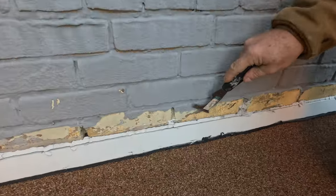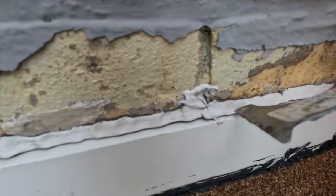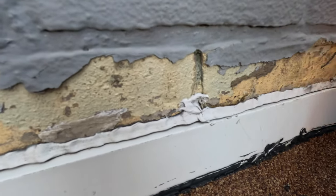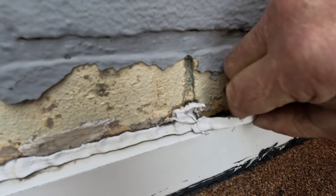On the inspection, I immediately saw that the flashing was the problem. I showed my wife and said, look — the flashing is pulled away from the wall, the caulking failed. It was very clear that was the leak.